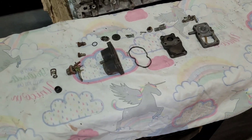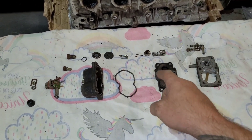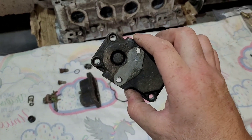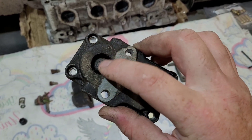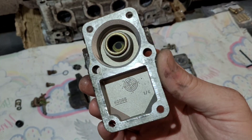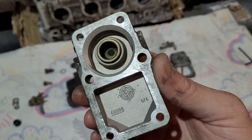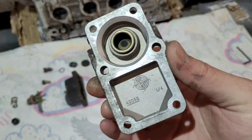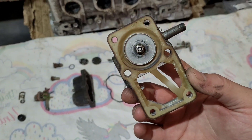Now we've got it in a stripped-down state, we want to focus on this part. There are two ways you can do this — the proper way is on the cover — but we're going to drill a hole through this little cap. You can see pretty much where that dot is in the middle, but if you drill through it and leave swarf on the inside, you will end up splitting the diaphragm that sits around there.